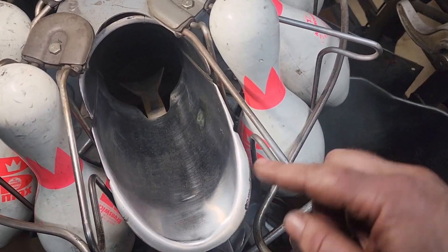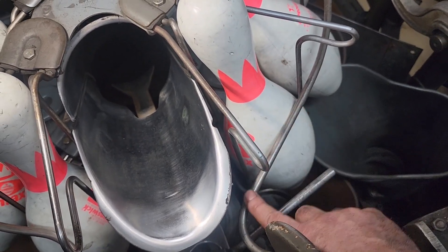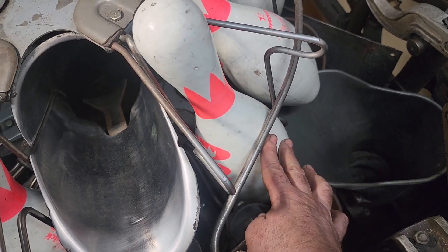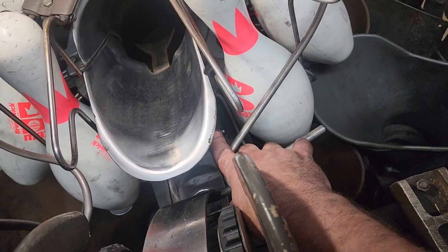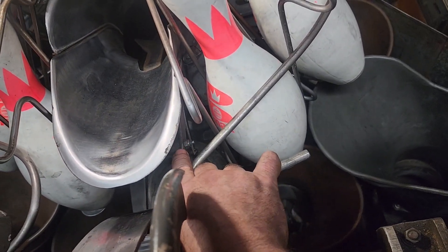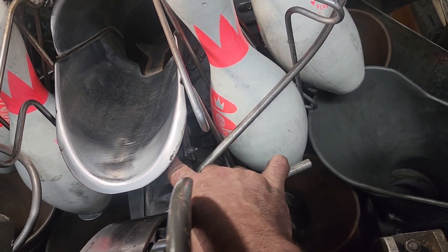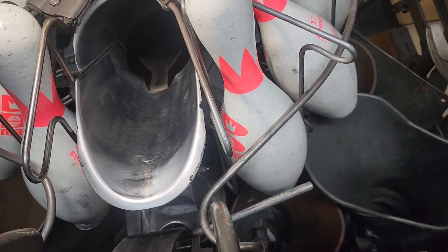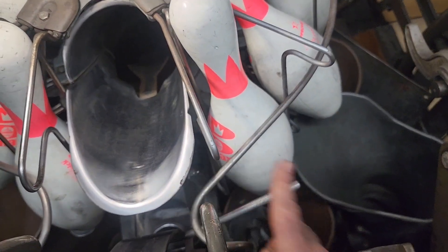In addition to that high-rise turret wire and the extra gap, the halo was set a little bit high. I've got it almost touching the pin now, but I've made sure there's clearance between the mount arms for the interlock probe so there's no bind as the turret indexes. We're good there — not touching the pins, not scraping, not causing a bind.